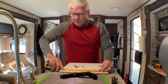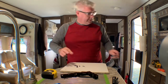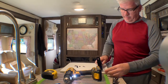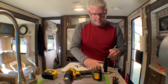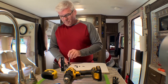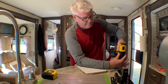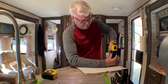It's really important to take good measurements for a project like this — measure twice, cut once. The first thing I did was measure where the beams were on the sides of the island, because if we put this into a place where there's no solid connection into the beams and the frame of the island, the whole thing is just going to tear apart. After making those measurements and marking the holes on the hinges, I went ahead and pre-drilled holes.